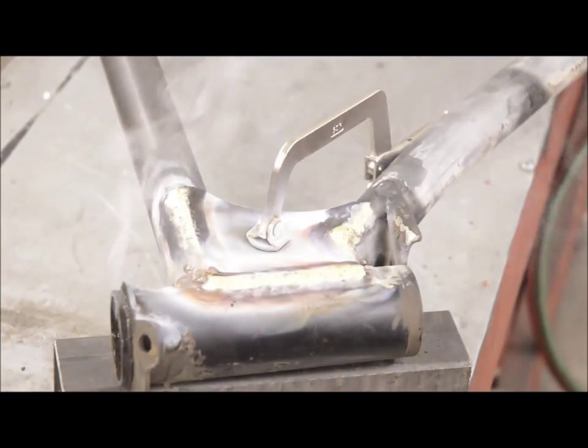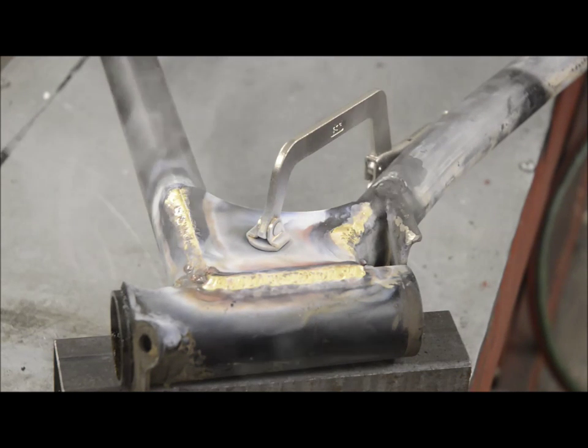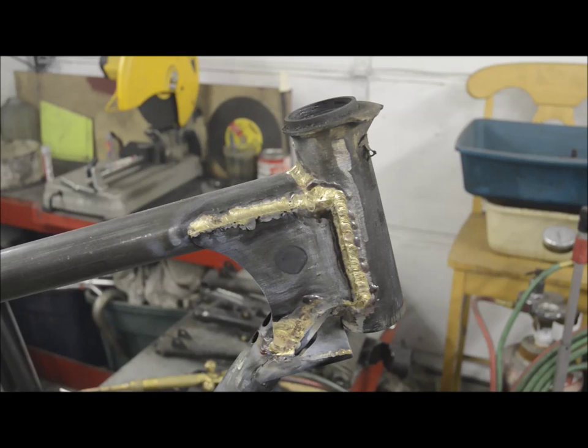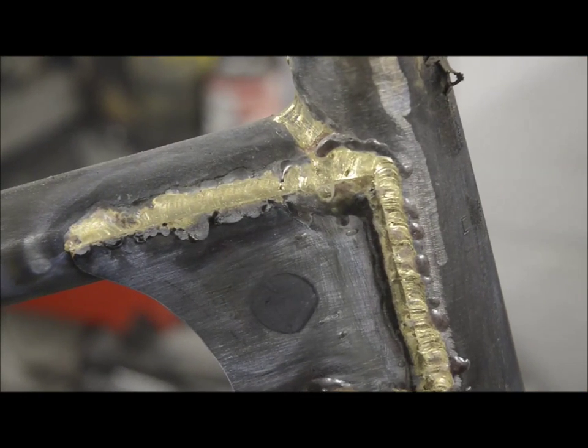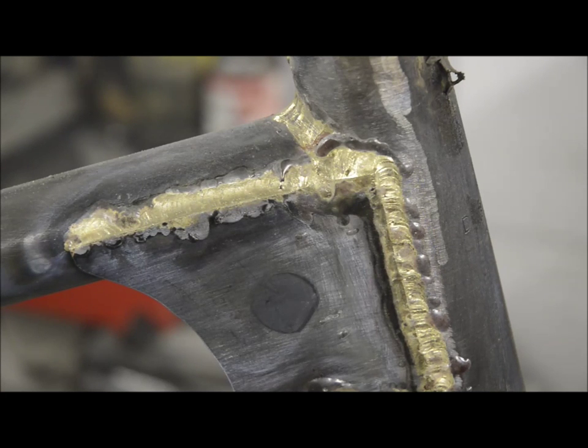The green, and we'll see what it looks like. Bit of smoke, but apart from that, looks to me to be pretty good. And here you can see the finished bronzed in gusset plate. I'll get technical and zoom in here so you can see the weld. Little ripple marks in it, and you can see the way that it actually flows into the joint, particularly along the top, that curved shape. It's a really, really strong joint.